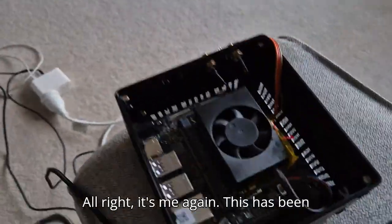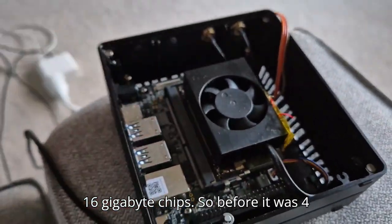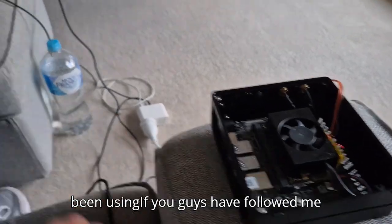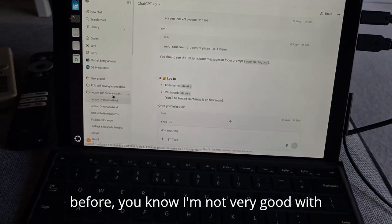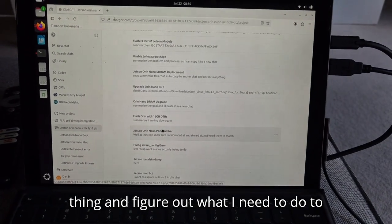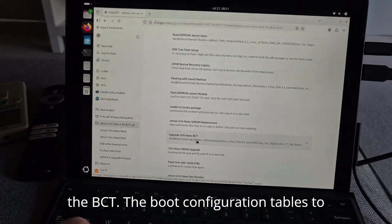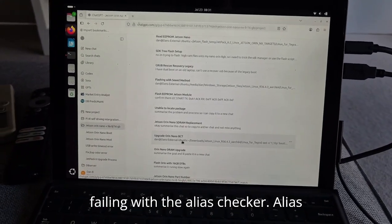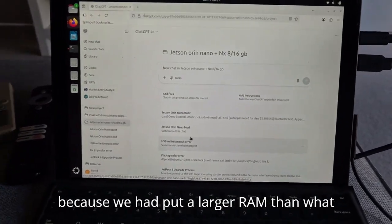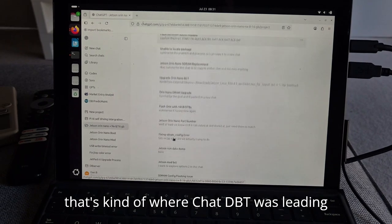It's been almost a month and a bit since my last video. This is still the Jetson Orin Nano 8 gigabyte modified with 16 gigabyte chips — before it was 4 + 4 gigabytes total 8, now it's 8 + 8 totaling 16. The past month I've been using ChatGPT to help me hack this thing, and from what ChatGPT was telling me, I needed to fix the BCT — the Boot Configuration Tables — to match the new SDRAM. It kept failing with the alias checker saying there was a mismatch, which made sense because we put larger RAM than what was in the BCT tables.